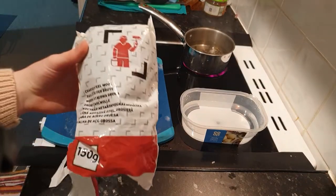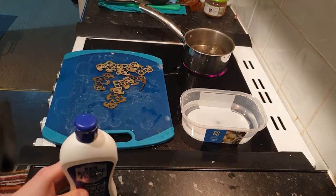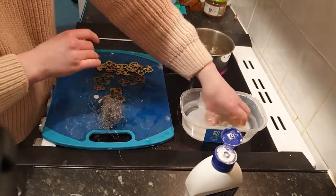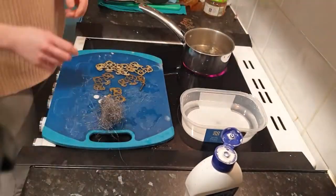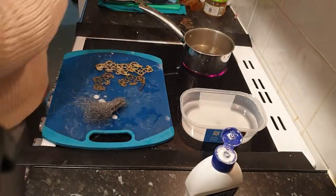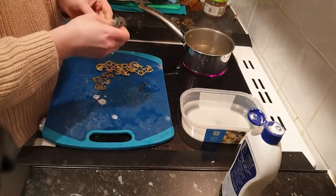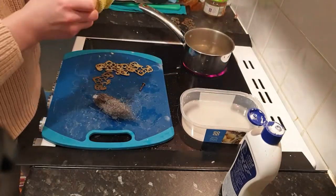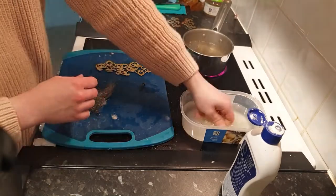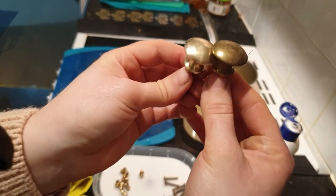Next up, it was time to give the hardware a really thorough cleaning. I used coarse steel wool and barkeeper's friend. As you can see, I'm boiling the handles in hot water and vinegar mixture, and after that I'm just grabbing the barkeeper's friend and steel wool and giving it a rub — and it comes out just beautifully. I really like to keep the original hardware of any piece if I can, because I think it's just part of the piece. And as you can see, it has really turned out beautifully — we gave this hardware a new life.